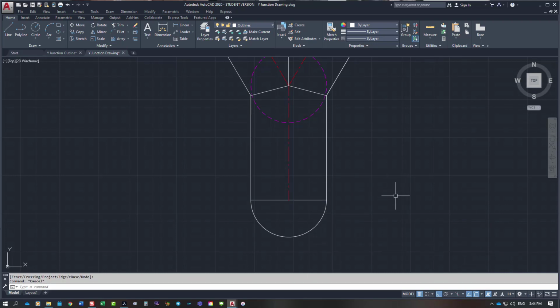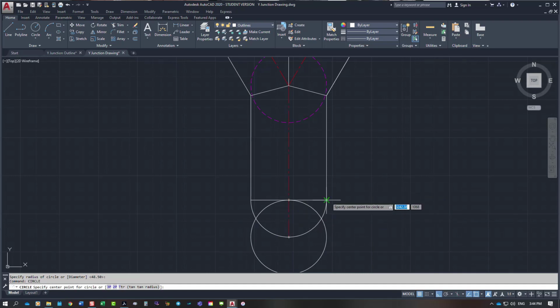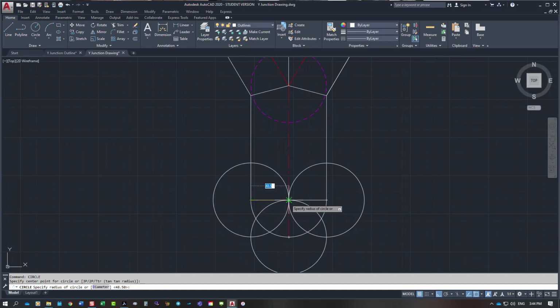I will extend my center line down to the base, and then I draw my circles out the other way. Once again, you will be using your compass at this point to create these points that I am having to do a different way. It's exactly the same process, it's just that in AutoCAD I have to do it this way. So I'm creating my points here on the bottom. I'm going to trim all this out and you'll see my points.